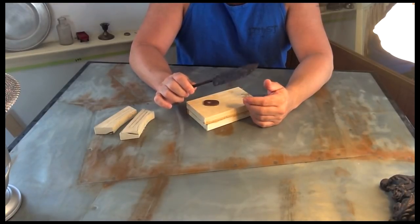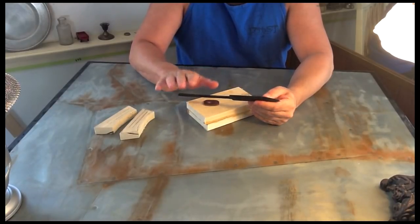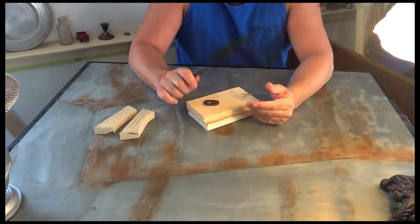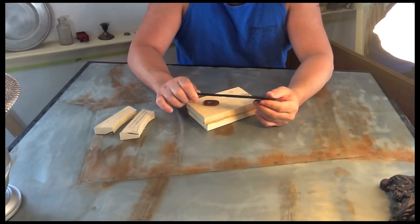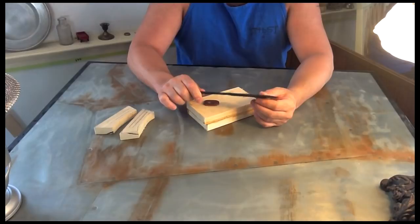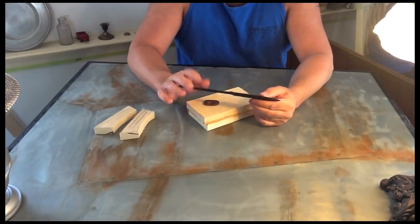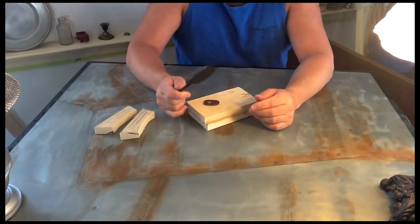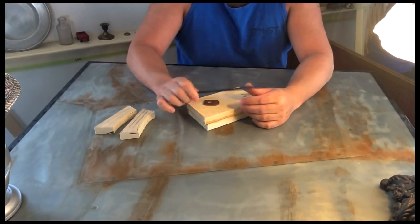And I said, I might as well give it a shot. And it worked great. You're supposed to get it nice and hot, even cherry red, to the point where it loses its magnetism, which it did. It came out perfect. I quenched it in oil, then brought it inside, cleaned it off a little bit, and threw it in the oven at about 450 for about an hour and a half, 2 hours. Woke up this morning, opened the oven to a nice, crispy knife blade.